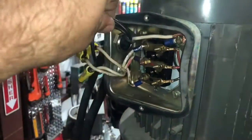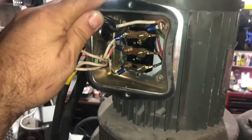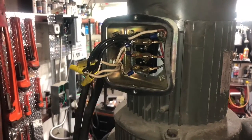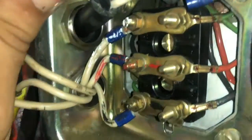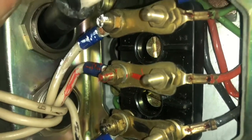This line here, as you'll notice right away, it's coming in and going right back out — what that's doing is it's going to this reversible switch and then coming back in here. Now if you don't know what you're doing, or if everything looks the same and you're not sure when you go to put it back together, it's always good — the best thing is to take videos or pictures or write a diagram down. In this case, where everything is almost exactly the same, I marked it with different color markers that I had.